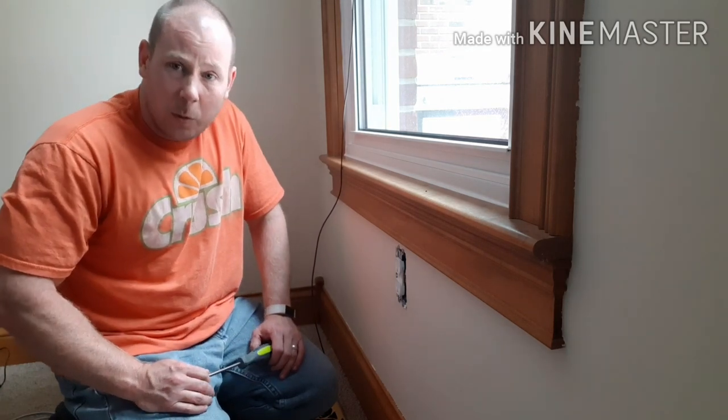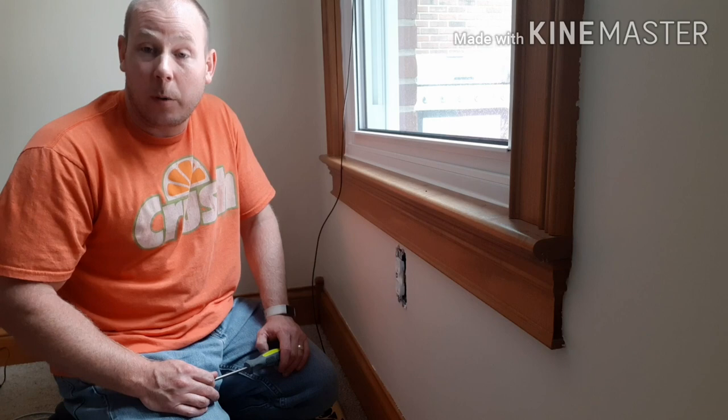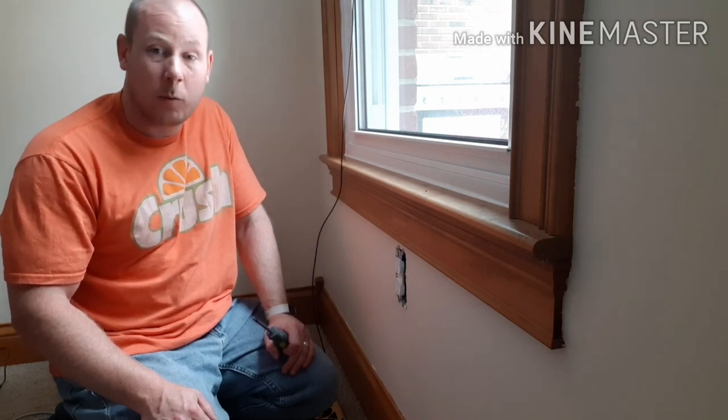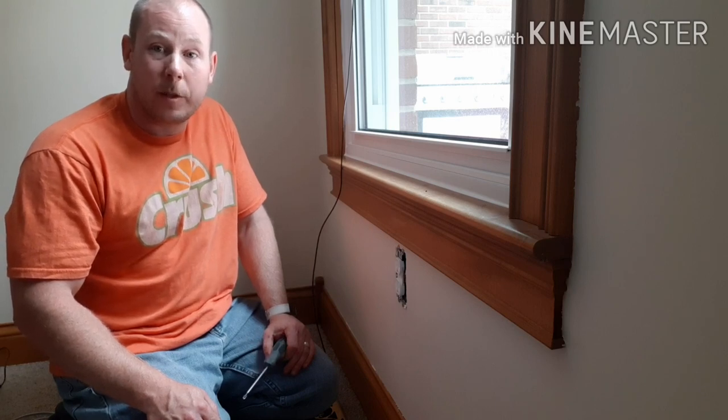Thanks for joining me here at Lincoln's Creations and Rentals on this quick and easy tutorial on how to change an outlet. If you need more direction on the GFCIs, I may do those at a later time. I may also do some light switches — there are standard single-pole switches which is just one toggle for one action, three-way switches where you use two to control one area, and four-way switches where you use two three-ways and one four-way for three switches controlling one feature altogether. Thanks for joining me — I'll see you guys shortly as I come up with some other stuff to bring to you.